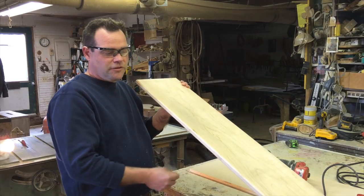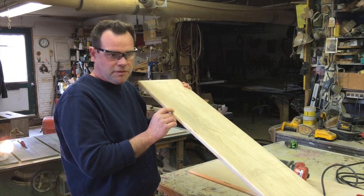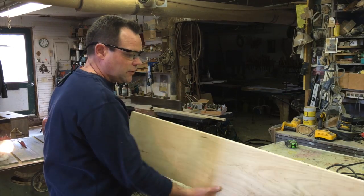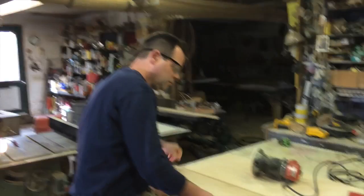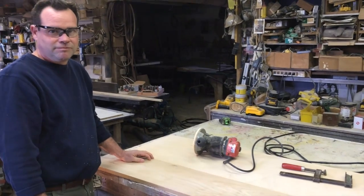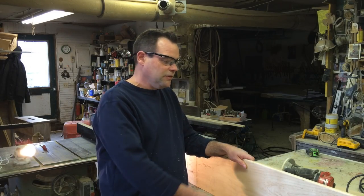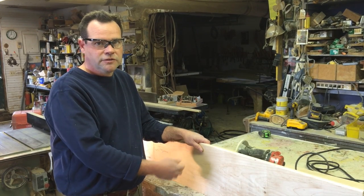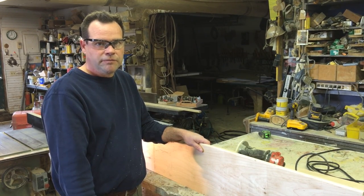When completed, your hardwood should have the same shape but opposite as the plywood that you used. The 2 should fit together seamlessly. The next step is to rip the wooden infill piece to 1/2 inch, which makes it easy to clamp.